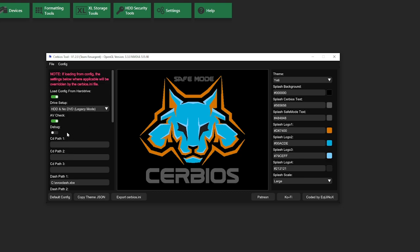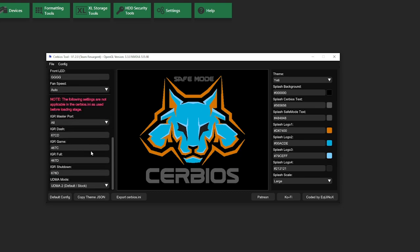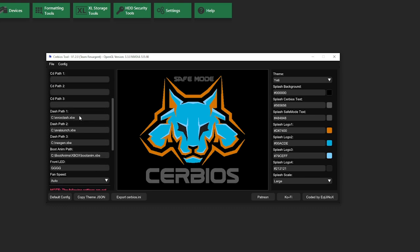So, some of the features we want to mess with here. I'm sticking with no DVD, maybe modern mode. And you can do dual hard drives with this setup if that's something you want to do. Not something I've dabbled with. I don't need more than 4 terabytes, but yeah, this one is where these are important. UDMA4 is what I'm going to choose because we're using the green ones. If you have the StarTech, you can go up to UDMA5 or even 6, which is still experimental, but you can dabble with UDMA6 if you'd like to. Fan speed auto, yes.